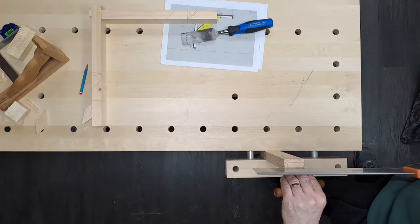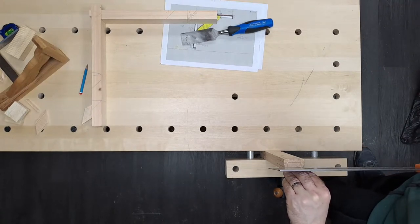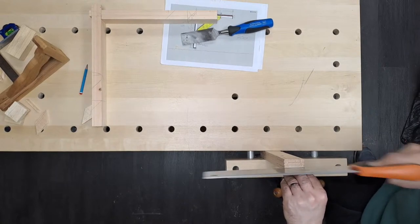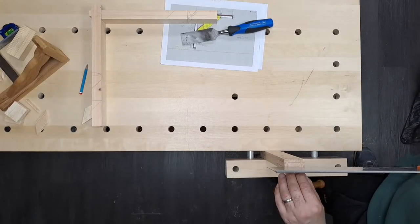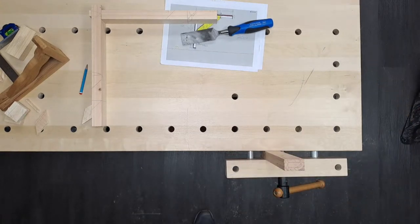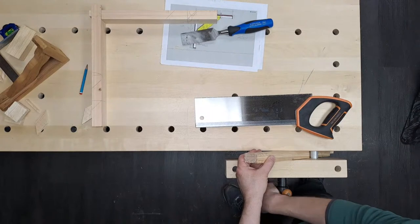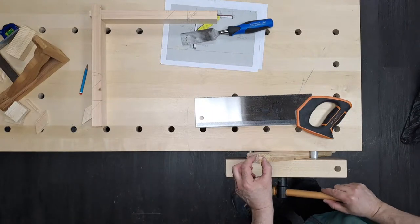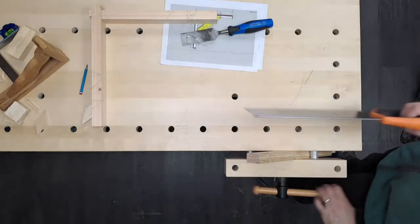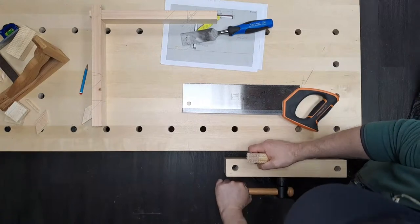And let's get that one in there. Starting off here at a slight angle so I can level it out. Get that down. So that's a bit of a line on each of those tops. Now I'll tilt the timber so that when you're looking at it from the top, that's good from the top. When you're looking at that, I don't have to get down on my knees. I can then cut down here. I can see that kerf line, and now I'm going to cut down here. And whilst I'm at it, I'm going to do both sides, both outsides. And put it in a bit steeper. This goes in there.